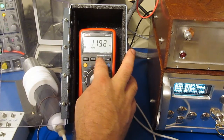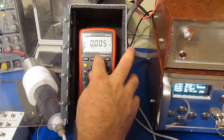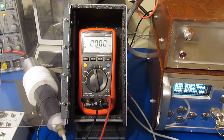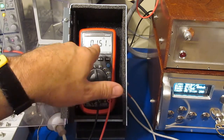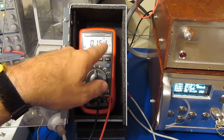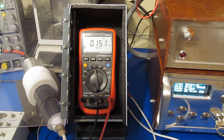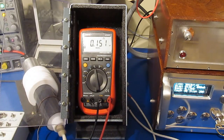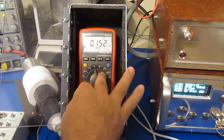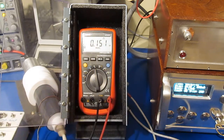So normally the way you're going to use this anyway is you're going to rel this out and you're going to select your capacitor. So again, this is 150 picofarad. A lot of the meters that I test can't even read down this far. But yeah, it seems to be fine. I think I'm going to leave all the calibrations and everything just the way they are, still from the factory. And again, this added capacitance is due to changing out those 2 transistors for some TVSs.